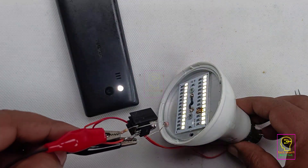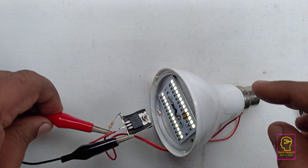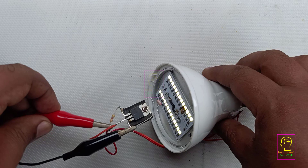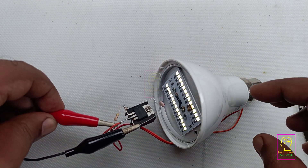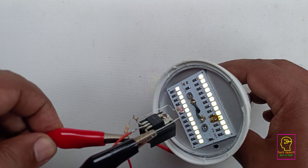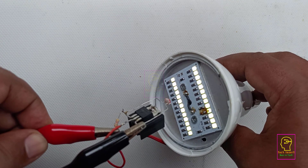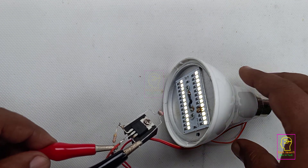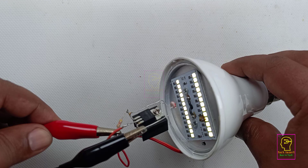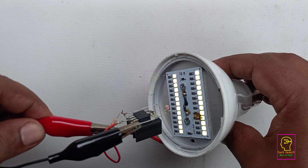What I am doing now is directing the light from the LED bulb — our load — to the LDR, but the load is not switching off completely, it is only dimming. Actually the load is switching off, but when it switches off the LDR no longer gets high intensity light, so it switches the load back on, the LDR senses high intensity light again and switches it off, and this cycle continues. In reality the load is flickering at high frequency, and due to persistence of vision we cannot identify it switching on and off completely — we perceive it as an LED bulb dimming at low voltage. In short, we can call this a feedback cycle or oscillation.